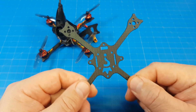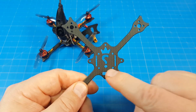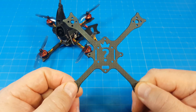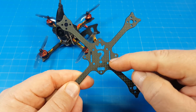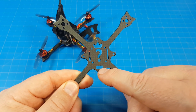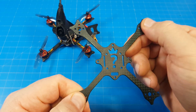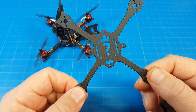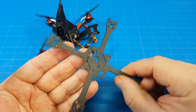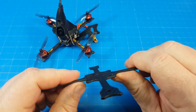We've got pretty good gaps around here and if you're looking closely at the frame you can see you can do a 16x16 stack. You can do a normal whoop board, a downward or vertically mounted USB port, or off the side as well. This is only going to run 65mm props or two-and-a-half inch props. I think I am going to build something on this mainly because I really like the carbon fiber — if you're looking for a two-and-a-half inch in this class, this seems to be a pretty good stiff frame.